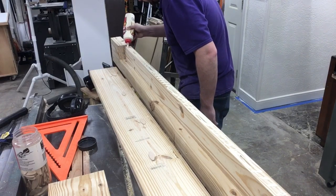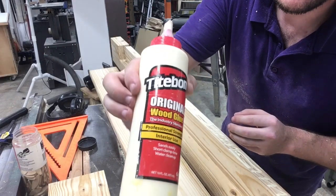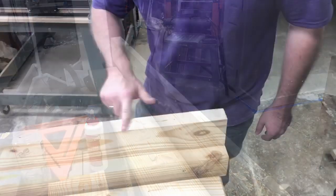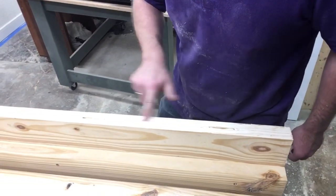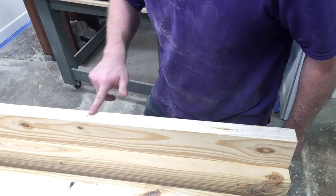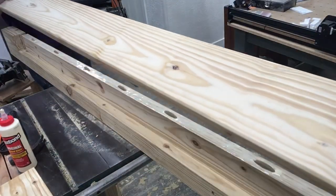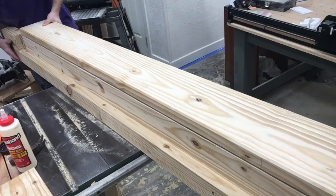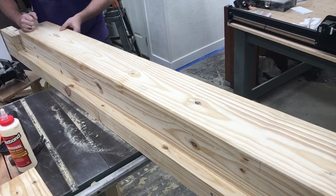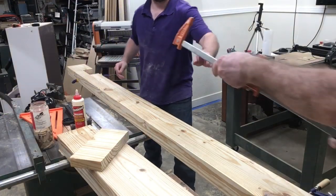For this project we're using quite a bit of glue and the product I chose is Titebond original formula — I use it extensively in the shop. I'm not sponsored by Titebond but it is a very good glue. My son uses the famous finger to spread the glue, just as I do — it works pretty well and you always have the finger handy with no need for an extra tool. With all the glue and biscuits in place, it's time to put the top of this platform into position. It takes a little work to get all the biscuits aligned, but that's the beauty of this process — it helps align the wood. Now it's time to add clamps.